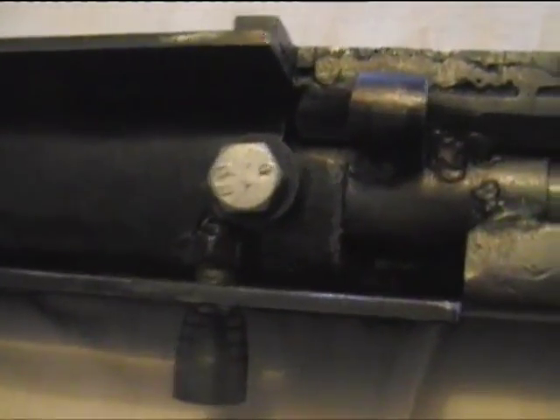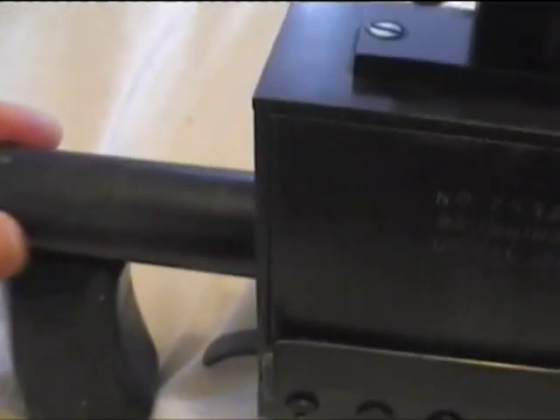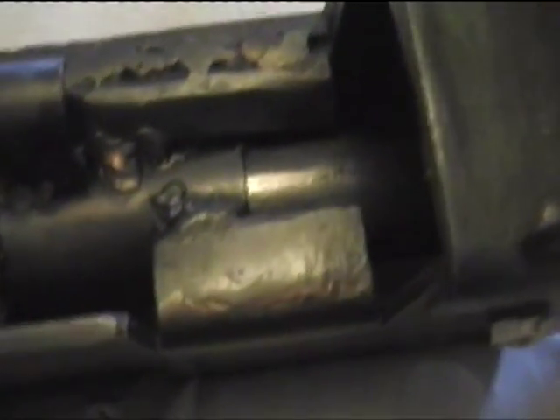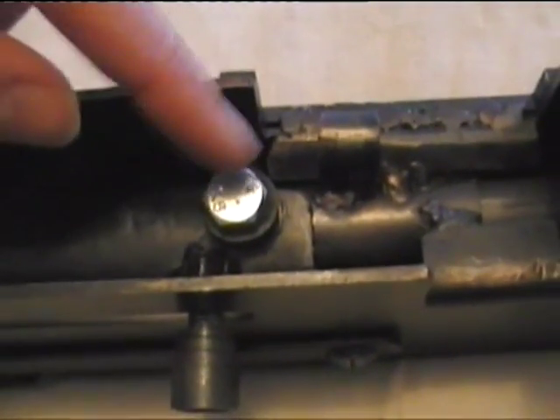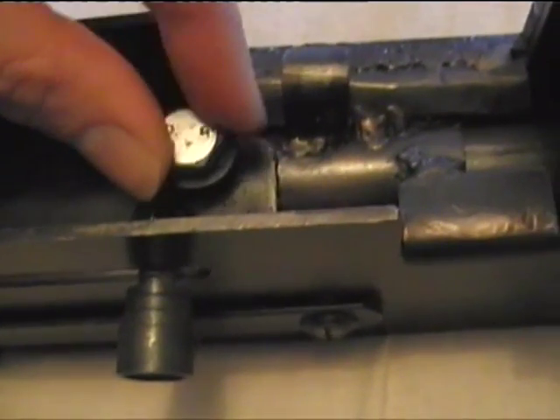Here are some of the details I've left out of my plans. I have a pipe which runs all the way through the receiver and comes out the back — that's one pipe all the way through. It has the spring inside it and the bolt. On this end here we have the bolt, a big heavy piece of steel bar running down inside the pipe to approximately this location, and it's got a tapped hole and this bolt here fits down through it.